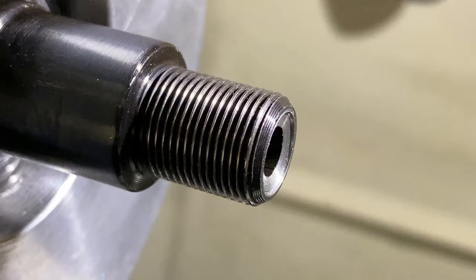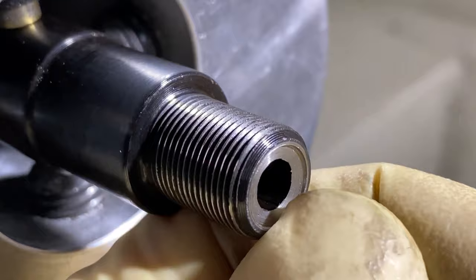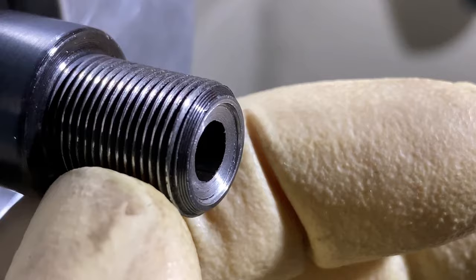That's what our crown looks like. I do apologize for having my head in the way — I did want a better vantage point while I was cutting this. You can see we have a nice 11-degree crown and a nice little recess there in the barrel as well. Now all we have to do is finish it — whether that be a bluing solution, have it nitrided, or whatever you're really going to do. And that's pretty much it for cutting a crown on a barrel.